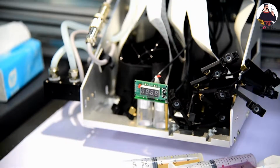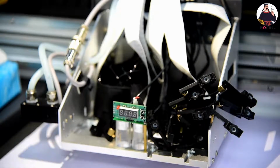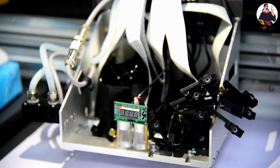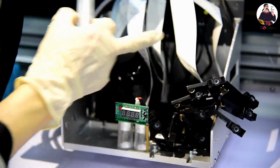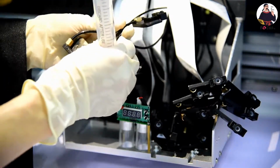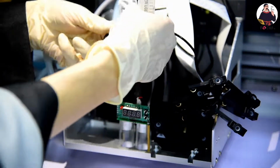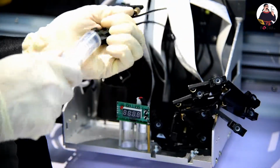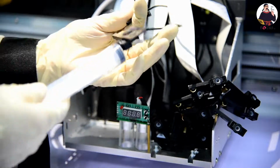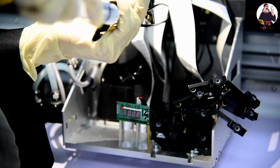That's really important. We must do it a different way. These two tubes go to the same one tube. We need to block one. We bend it. We bend the tube this way and hold it with a finger, and then we start to load another one this way for white. Otherwise, the ink will go out of two ports and cause leaking.